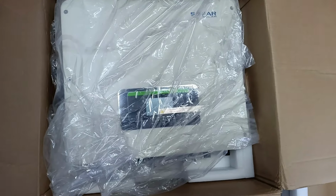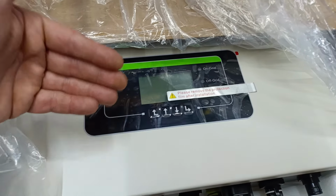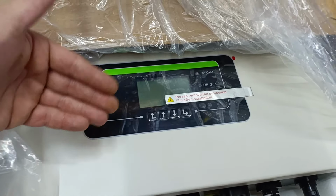Right, yeah, evidently. One thing that's been driving me absolutely potty with the Lux inverter is everything is so heavily web-based or app-based. Even something dead simple like your battery bulk charge voltage, you can't do it via poking buttons. You need to do it on the app on the mobile phone, and if you try and do it on the computer there's no option to change voltage via a PC or a Mac. So that's been really frustrating.